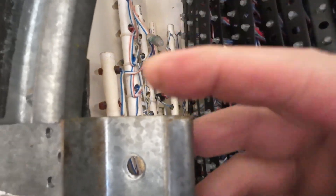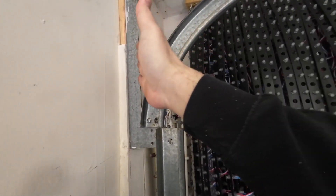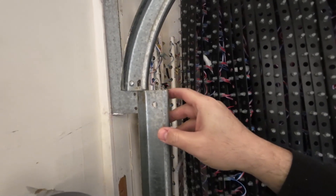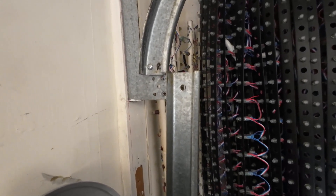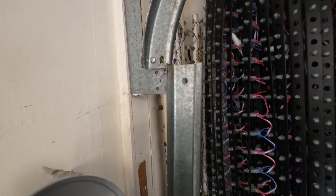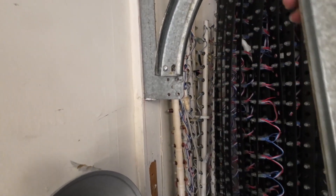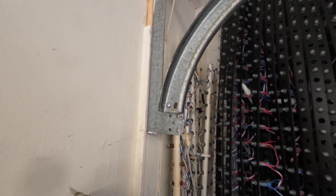I'm going to have to take this whole thing down again. I need to put a piece of two-by-four and a one-by-four — that will give me enough space to push this out to basically align with this piece right here. Each garage door is going to be different — this is just how mine is. A lot of the ones I've seen have the same configuration, but they don't really go into detail because of how different each garage door is. Let me put the wood there, reinstall this piece, and we'll come back and see if we're fully leveled and adjusted.